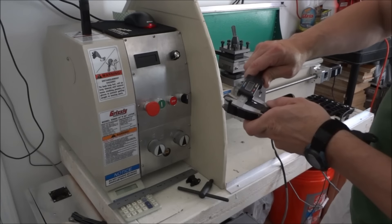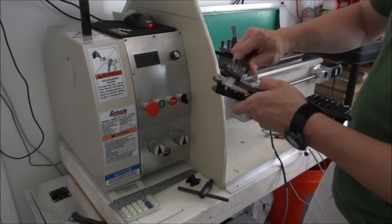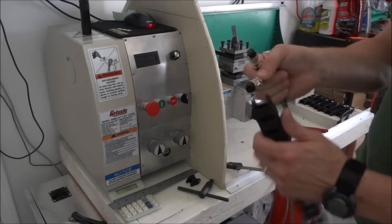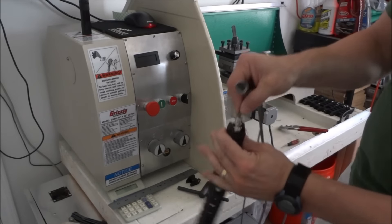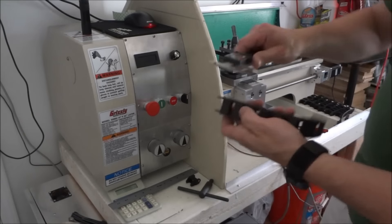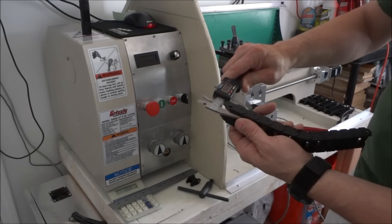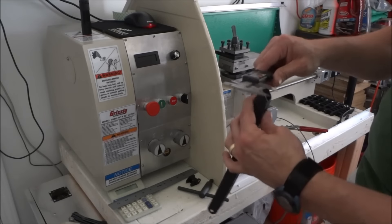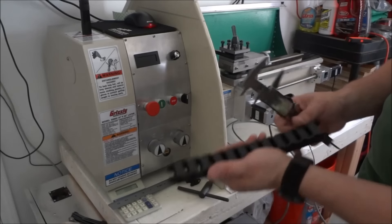The problem is I didn't order it quite big enough — I wasn't sure what I would need. It's only 20 millimeters thick and it needs to be a little bit thicker because my aviation plugs won't quite fit through. You need something at least 24 millimeters thick and the width on this is 27, so something wider — maybe 32 wide and 24 thick — should be just fine.